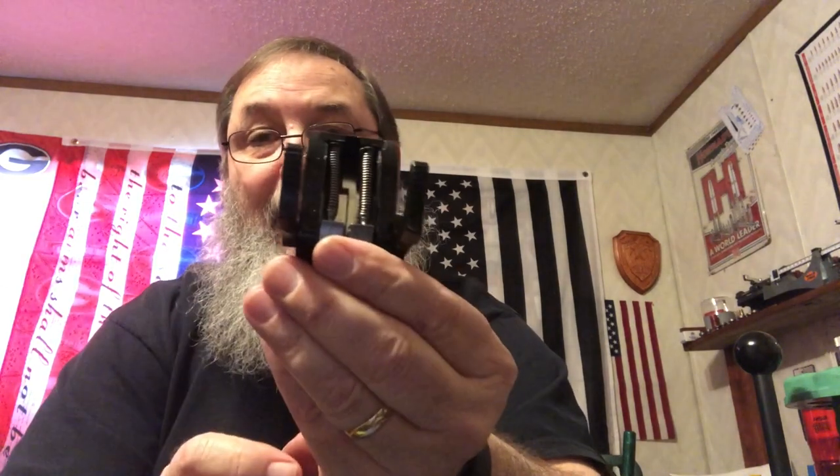Now I'm going to give you a warning. These springs right here — they're fairly easy to get out, but you're gonna pay the devil getting them back in. If you accidentally drove that wrong pin out, you're going to need to get those back in. So I went to Walmart, bought a cheap set of channel-lock pliers, and I made these. You can see the slots — they fit around the pin but grab hold of the spring. You make these with a grinder and a Dremel tool in 15 minutes, and you can just reach in there, grab what you've got, and get them in and out fairly easy.